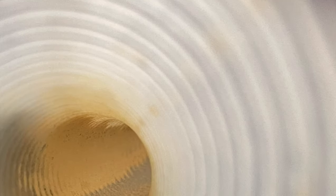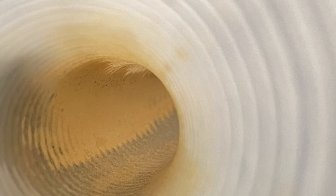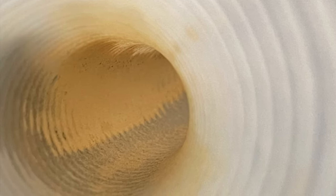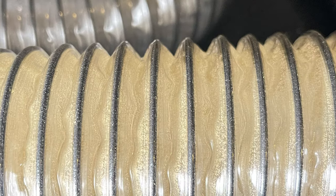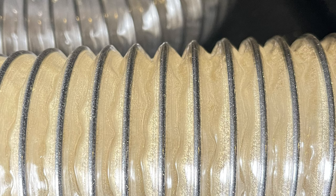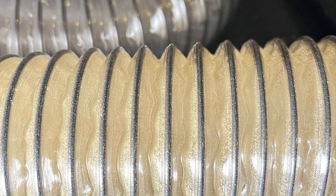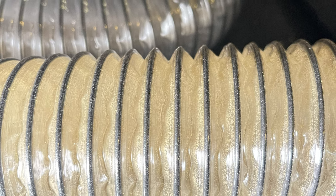So now we have a method to accelerate particles by pushing them through a curved tube so they may collide with each other and triboelectrically charge. Since particle velocity is so important, the pipe diameter must also be carefully selected since they're both related. A small diameter pipe with lots of air may cause such strong particle impact that particles may explode and cause agglomeration or accumulation on pipes. The greater the pipe diameter, the greater the CFM of air required to accelerate particles. If we do not have enough airflow, particles will settle due to low particle velocity. If we have too much air volume, this will cause issues in downstream processes.